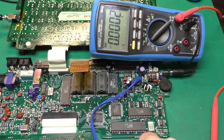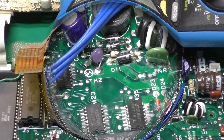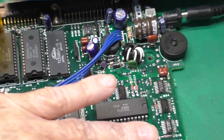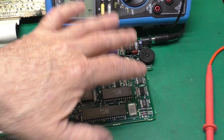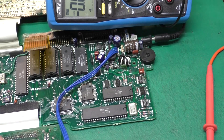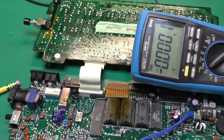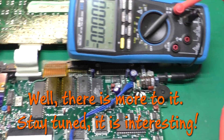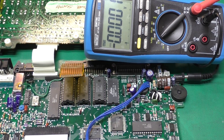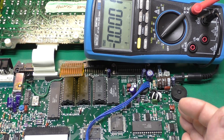So now we know we need to replace the battery. I noticed some bits of corrosion on the board — down in this area near the battery tray, likely from battery flakes — but it's not bad and will clean off fine. The owner also wanted some caps replaced. And of course I still need to find a proper power switch, because this machine is obviously not going to work without one. An interesting symptom turned out to point toward a simple problem: the memory battery.